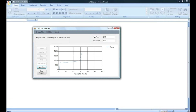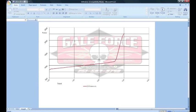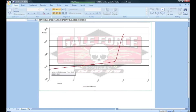We're done. Then we're going to See Results. When we click on See Results, the software will automatically put it over into Microsoft Excel Force, and we can see our graph here. You can highlight it with your mouse cursor to see exactly what you want — if you want to see a specific number. At less than 60 thousandths of an inch, we're showing 863 pounds. And our final load is at 3 inches.